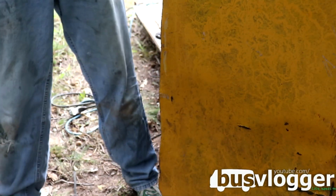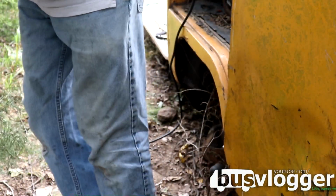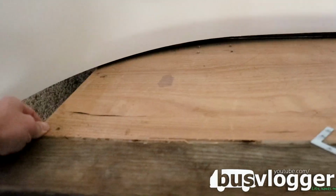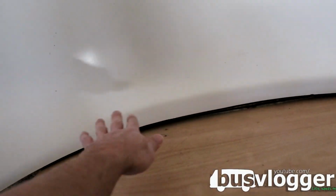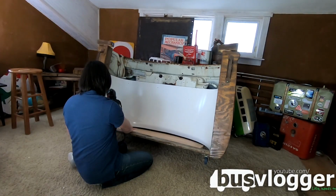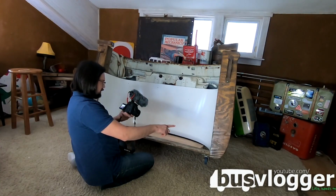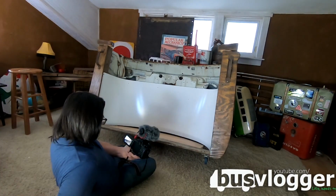So inside on that edge, I started with a piece of old oak 2x4 on both sides. Of course, making sure that it would be level along the bottom. I blocked out with some oak 2x4s in the front to make it level with these 2x4s on the side. Then we started with some scrap 1-inch plywood and just a scrap piece to bridge across from one door to the next. And then I found some decently heavy duty casters. I hope they're heavy duty enough.